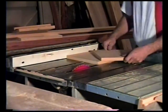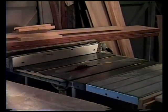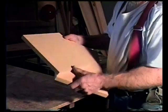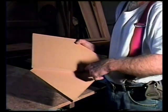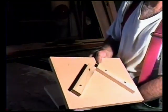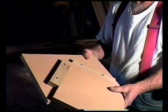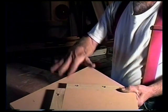Okay, we've got that done. Now what you're going to do is make a pattern to where you can screw a couple of cleats and put one screw in here to hold this down flat — you'll see what I'm talking about in a second — so that you can cut your shelving. You can see what I've done here. We've got a slide made up to where we slide this in here like that, and then we're going to put one screw back here in the back. Usually back in the back of your cabinet you can fill that and nobody will ever see it, being this paint grade.